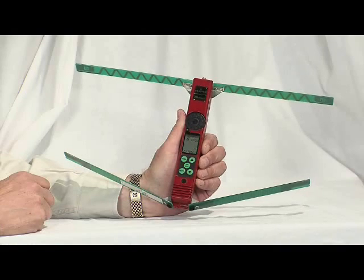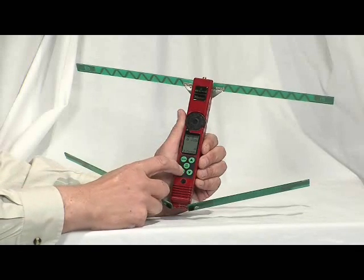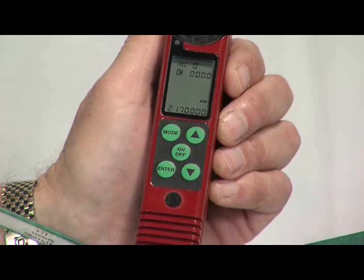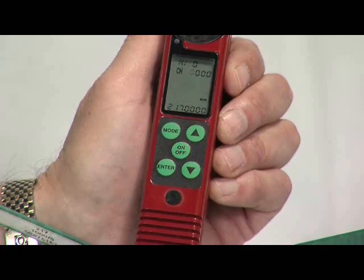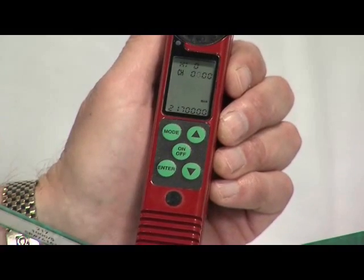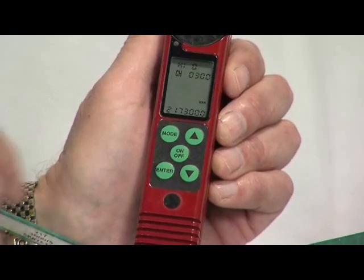Let's try an example. If your receiver is a 1005 with 217 as the base frequency and you want to program in a 217.325 transmitter, start by pressing the mode button. Make changes to the blinking digit so that the frequency you want to place in memory is seen at the bottom of the display. Since your receiver can only pick up frequencies in the 217 band, you only have to program the last three digits. The first number to the right of the decimal is the first number that can be programmed, so hit the up button until you reach the number 3 and press enter.